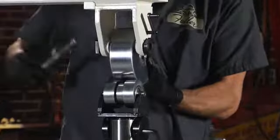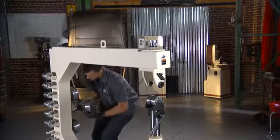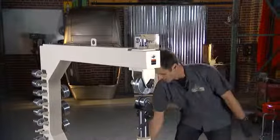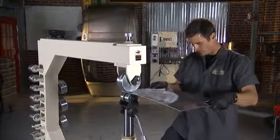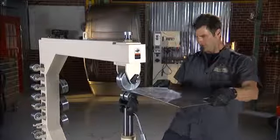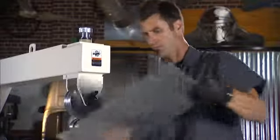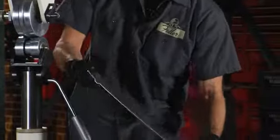I'm going to pull the quick change, pull the upper out, and replace it with one of our other dies, which matches. Switch it out. Okay, that simple. Lock it off and it turns into a bead roller this fast. Watch how cool this is. I'm going to start with a beginning pass, crank it up some. Turn it up, turn it up. Now, wheel it through. Now we have a beginning pass. All right, look how nice that bead is.